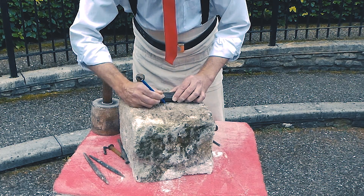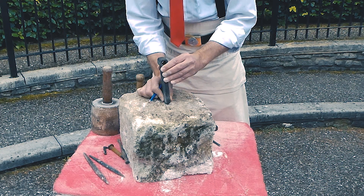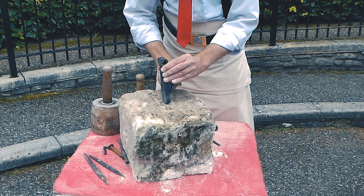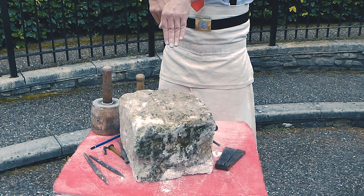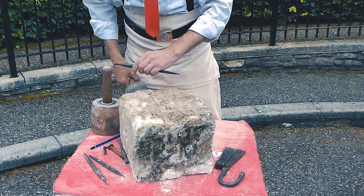Mark that on there. Then we want it pretty tight — we want the thickness. What we're going to do is sink straight down first of all, square, and then we'll open up the creeping Lewis from there.